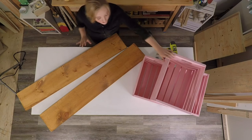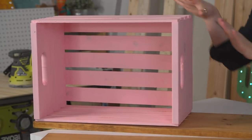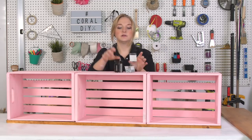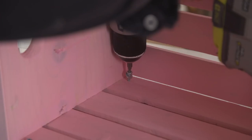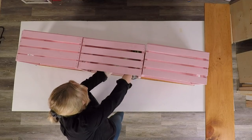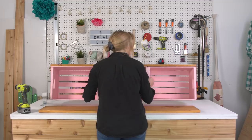Now let's put this whole bench together. I'm taking one of my boards, putting it on the bottom, lining up my three crates beside each other, and I am securing the crates to the wood. What I've sourced is a 5/8 dome head screw, and I have a washer that's going to go with it. The washer will ensure the screw does not rip through the crate, which is a very thin plywood. Place in four screws per crate, two at the front and two in the back. Flip it over and do it all over again.